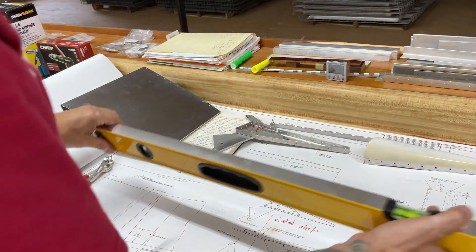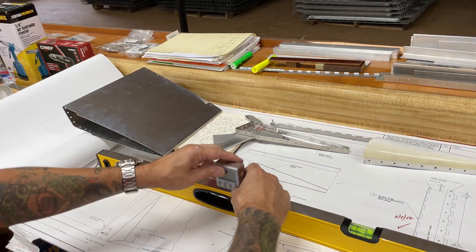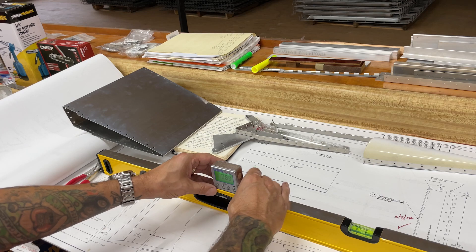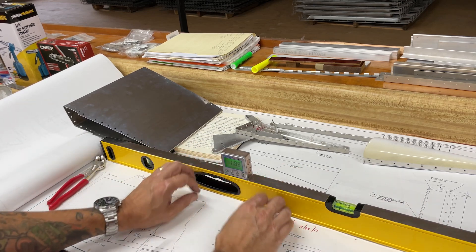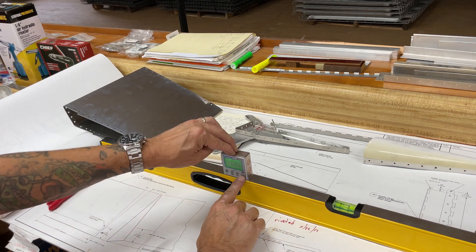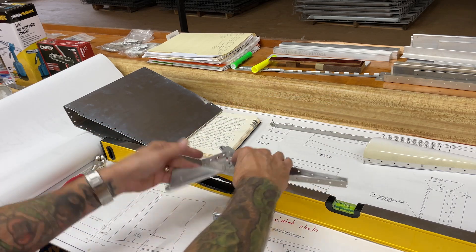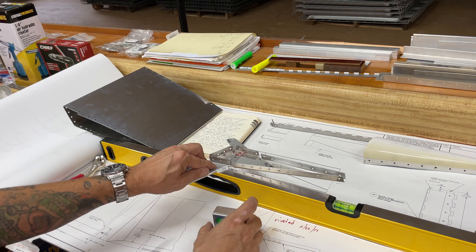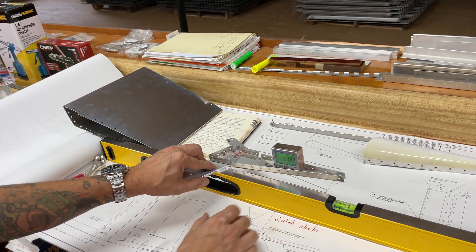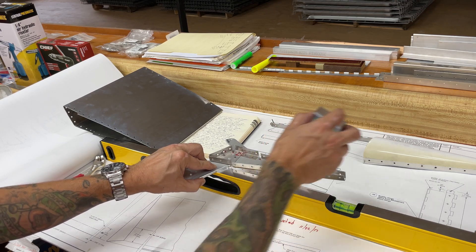One of the critical parts was the bend angle in the drive horn. I wanted to make sure that that was relatively close to the five degrees called for by the plans. It looks good by eye but I decided to double check that with a little digital level and flat surface. I zeroed the level to the surface that wasn't necessarily level, but sure enough it was just barely over five degrees, so Steve did a good job on that bend.